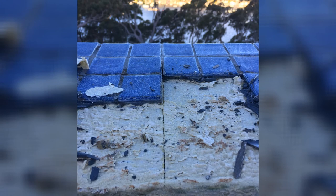I was exposed to a horrific repair job over the last couple of months where a tiler had laid mosaic tiles over the membrane and then decided to grind through them for movement joints afterwards. Inevitably it failed. When those tiles were pulled up, you could see the grinder mark through the membrane into the render below. It was a complete afterthought — just putting a silicone joint in without planning where it needed to go beforehand. It all comes back to planning and preparation.